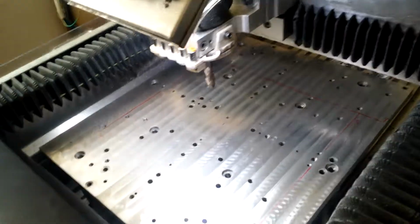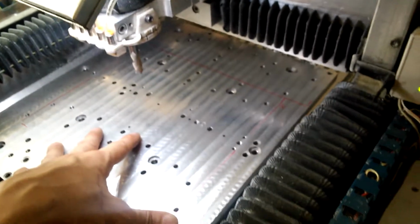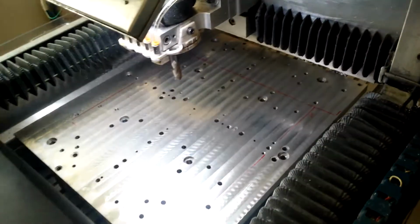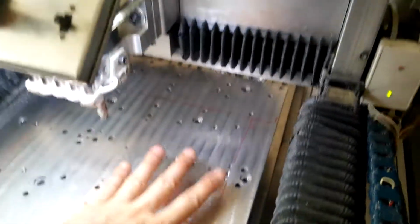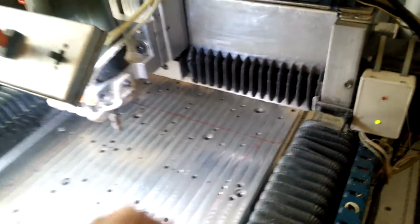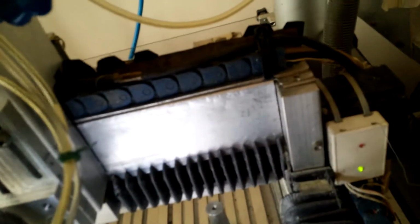So whenever I have a larger piece to be machined, I use this sub-platform to do it. And there are screw holes there, although not very many, but it's sufficient for me to mount it to machine. As well as I can adjust this whole Z-axis assembly to suit the height. And this is feathered and leveled. I'm machining it once when it's mounted on the cylindrical posts.